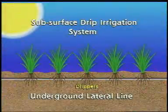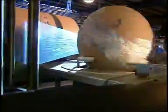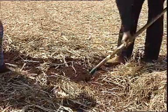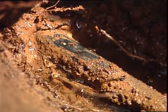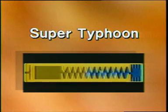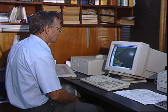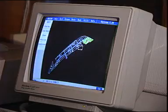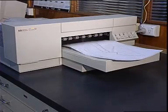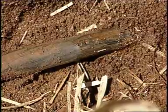An entirely new range of drippers have been developed to address the problems associated with subsurface drip irrigation. Because it's impossible to view the individual drippers without digging them up, Netafim had to develop a dripper that would provide accurate, efficient, reliable watering while remaining out of sight. The result is the Typhoon dripper, which features Netafim's patented tooth pattern for accurate flow rates. Detailed planning of the irrigation system must take place before dripper lines are installed, to allow for high uniformity in the distribution of water and fertilizers. Proper water quality will keep the dripper system in good shape for many years, achieved using a disc or gravel filter.